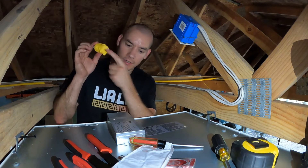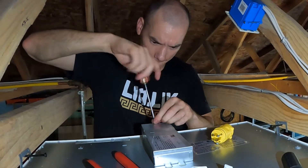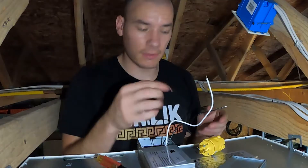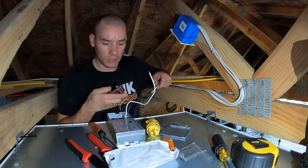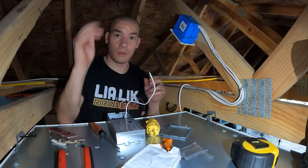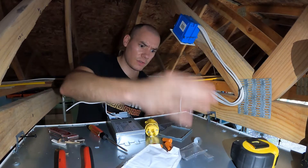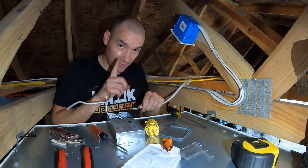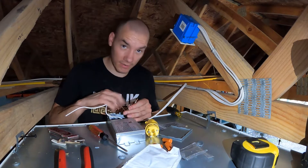Now I just need to connect a wire from here to here so that I can take this light and plug it in. Take this cover off. This light comes with wire nuts because it has a white, a black, and a ground. So this is the short wire I'm going to use — it's going to connect here and plug in here. In order to get it ready, I need to peel the insulation back again. Strip these — 12 gauge. I almost forgot — I'm going to go through the side here, so I need to punch a hole in this box. Those just break out of there. Now there's a hole that the wire goes through, and you're actually supposed to put a rubber or plastic grommet in here. I forgot to buy that, so I'm going to have to go back to the store and install this later. So all you electrical inspectors out there — please don't judge me, although I understand if you want to.